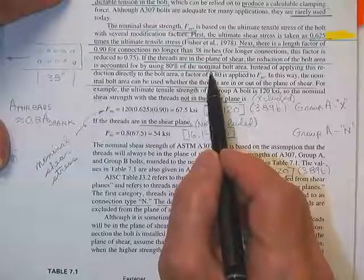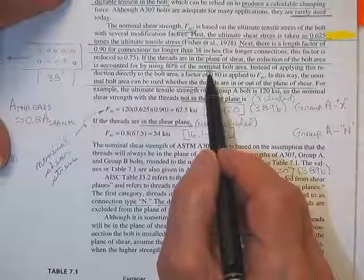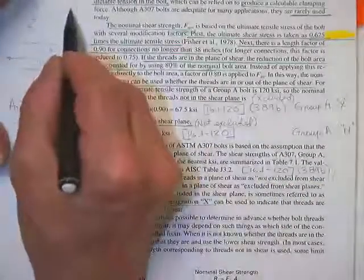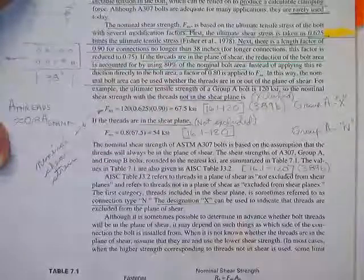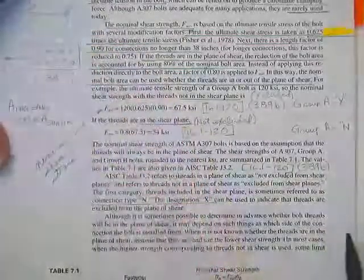But to get the tensile area or the root area, you're going to have to know how that thing was made, and know this dimension here, and the area of a thread. You have to figure all that out. They say, we don't want that. I say, well, you've got to do something, because if you cut the shank, you get your nice pi d squared over 4. He says, we're going to let them use that for everything. Kidding. You can't do that.